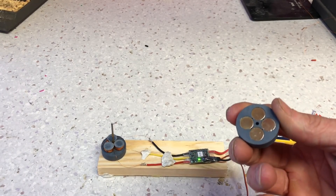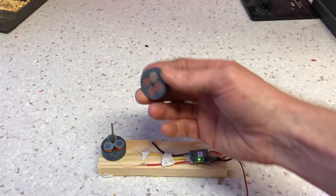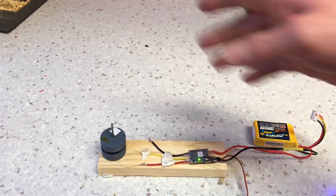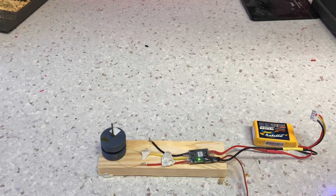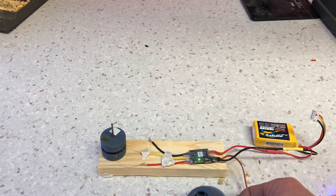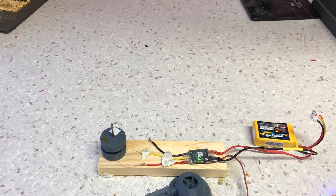Let's see how it works when we build this in the radial jet version. The jet part of the system can absorb a lot of the energy so it won't go too high — I hope. Also, the jet version of the motor has ball bearings, which make the vibration problem much less. I have these 2mm inner diameter, 6mm outer diameter, and 2.5mm wide bearings. Two of these are part of the rotor — one is placed in the intake.